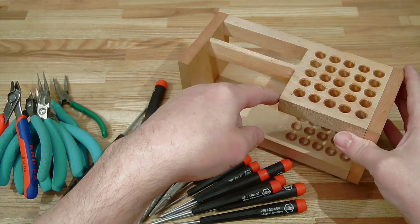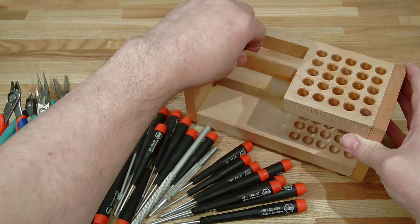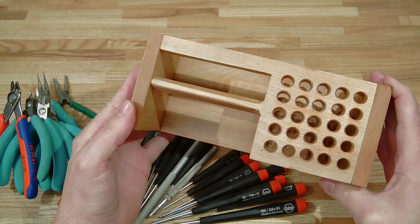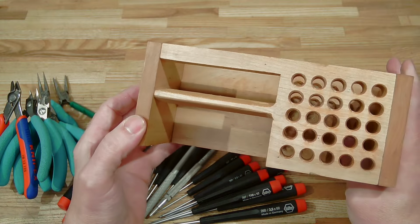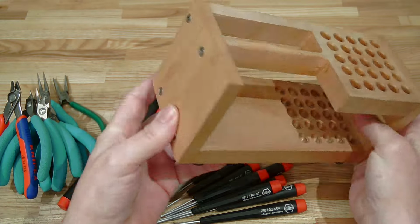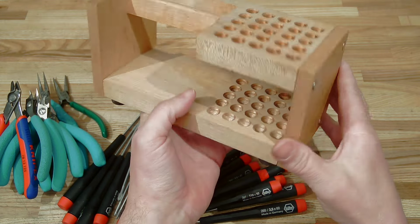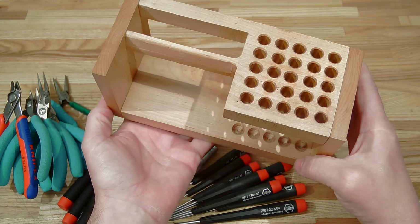And then after that's done, just use a handsaw. You can cut out these squares. Cut this one out into a triangular profile. See that? And then after you get that cut, just use some coarse sandpaper to smooth it out. And screw it together like so. And Bob's your uncle. You're done.